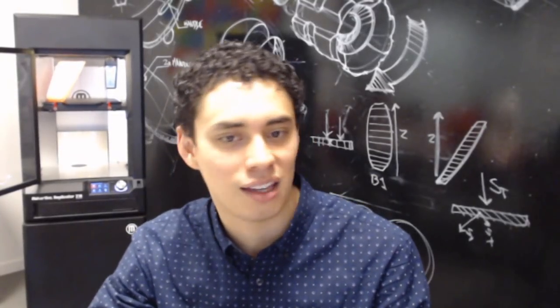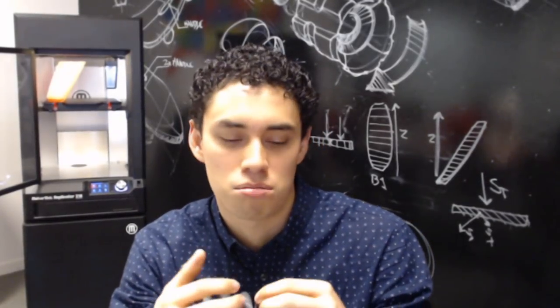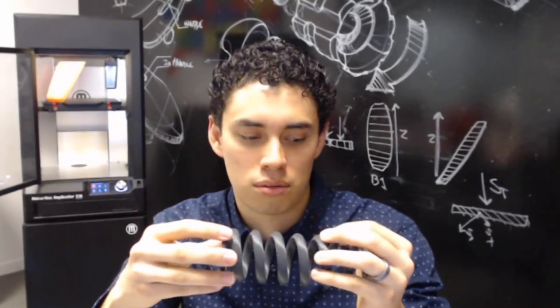Because as you're extruding the ABS, if you don't have a very controlled environment, it's going to be really hard for you to get a successful print. So for injection molding, it's a perfect material. We all know the Lego example. For rapid prototyping and 3D printing, I am still not sold on it, specifically because there are other materials that are not as aggressive or toxic and have better performance in many points than ABS, like Tough specifically, right?